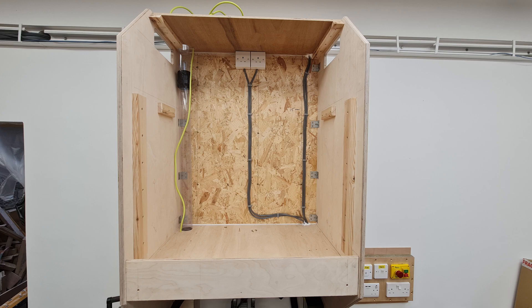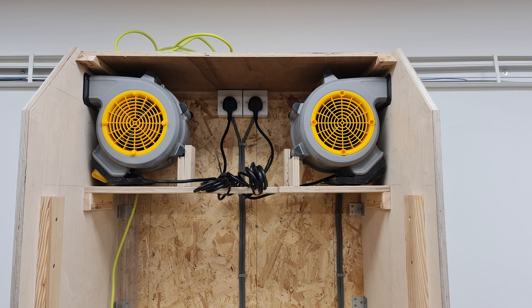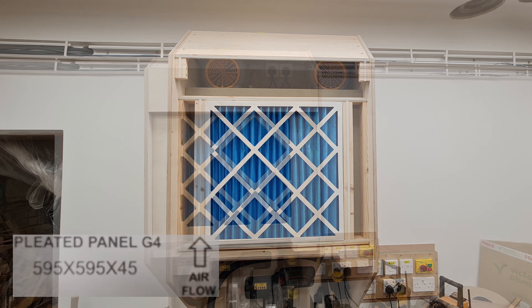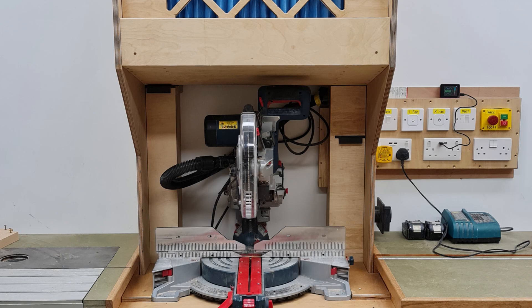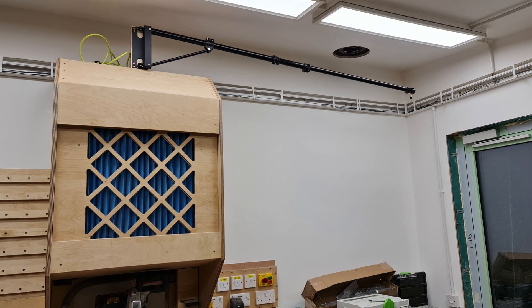Back above the bench now — here's the filter box wired for the fans. The incoming power comes from the high-level wall trunking and the light green wire is for the boom to serve a new workbench. The vacuum line at the left side is for the boom and is also teed off at bench level for the router space. The fans are installed and held in place with timber blocks and the filter frame is then fitted. The secondary filter is labelled and fitted, then the primary filter labelled and fitted. The top is fitted, the lower cowl is fitted. The left vacuum line is concealed in the saw area and the right vacuum line for the saw and sander is as yet unconcealed, with the blast gates for the saw and bench space visible. Vacuum lines are now concealed both sides. I fitted a camera boom to provide an overhead vacuum line and power line for my bench when I get it made. Some of the French cleat wall is now installed on the left.